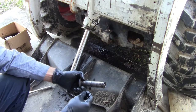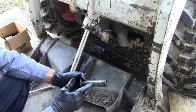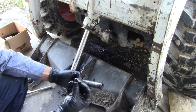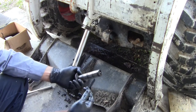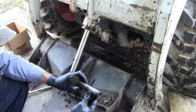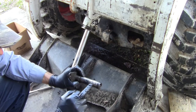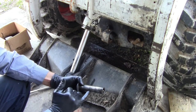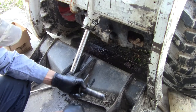A big reason I grease so frequently is to avoid the grease getting dry and hardening up. I've learned the hard way to buy better grade grease that won't harden up as easily or dry out — grease that will stay soft and liquid so these don't get packed up and will always flow out. While you're doing this, check these little holes in your pins, check the pin for wear to see if it needs replacing, and look for any stress cracks or fractures — I've seen those actually happen right where the holes are drilled in the pin. Clean it off nicely and keep it handy.